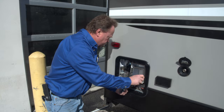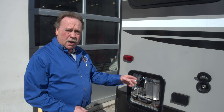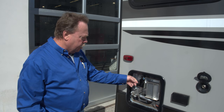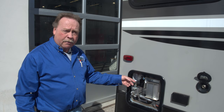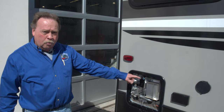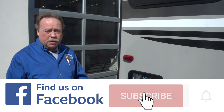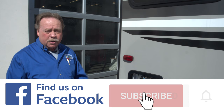We're just going to tighten the anode rod back in. Once we've got it back in, we'll go inside, turn on our cold and hot water this time, and allow water to enter the water heater. We'll open up the pressure relief valve — once water starts coming out we can close it up, then go back inside and burp the rest of the air out of the hot water side of the system. Open any hot water faucet on the inside until the air bleeds out the rest of the way, and then you're done.